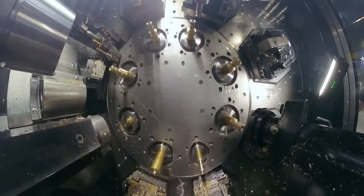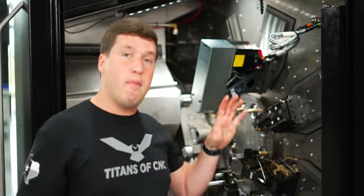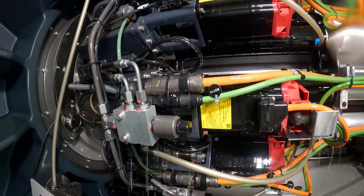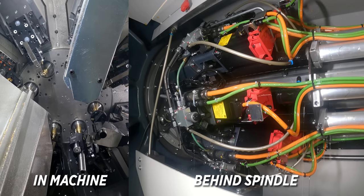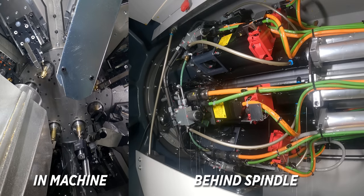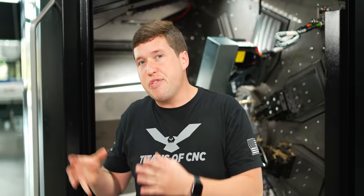Every now and again it does a really big rotation. That's because all the motors behind this drum have cables going to them, and as it rotates, that winds up. If it kept just spinning around and around, it would rip all those cables off. So on the eighth rotation, it actually spins back to station one — and that is how that works.